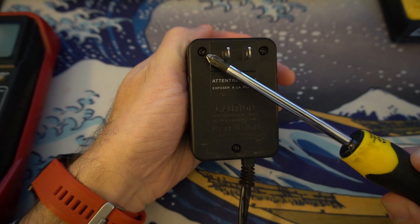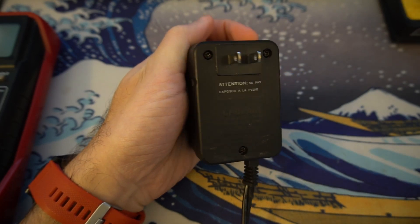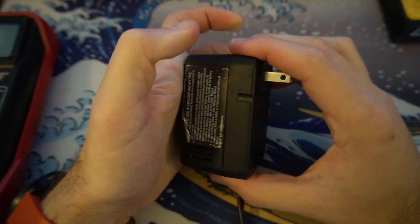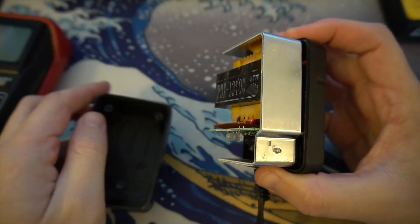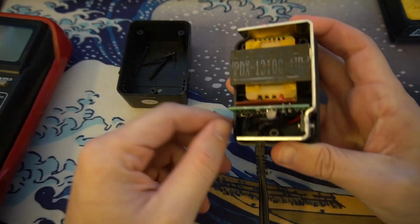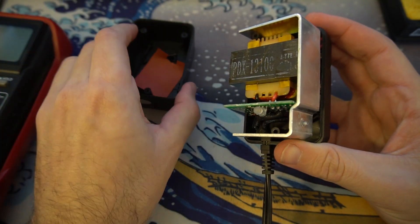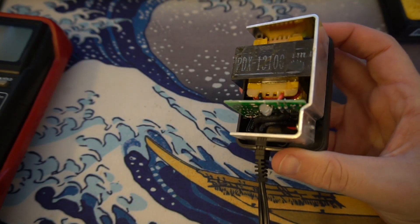The battery tender will have three Phillips head screws that you need to remove. Once those screws are removed, you can take off the outer shell and set it aside — I'll throw the screws in there to keep track of them. You can also remove the little paper filter at this time; keep it in the case and set it aside, as you won't need it until reassembly.